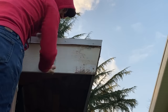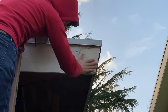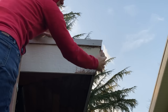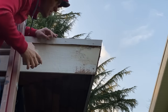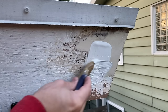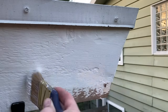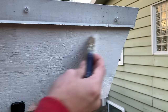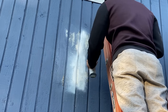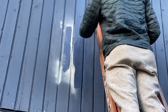After sanding, I take a small soft sanding block and sand the corner just to verify a nice crisp edge over the roof line. I then apply a bit of pressure to make a few small surface variances to help match the overall texture of the adjacent wood. Your surface is now fully ready for paint. I always suggest applying a primer layer first and then your exterior paint. With white you can generally get away with a good high-quality exterior white, but for a color like my blue, I strongly suggest priming first — applying paint color directly to the surface might look different than if you had primed first.